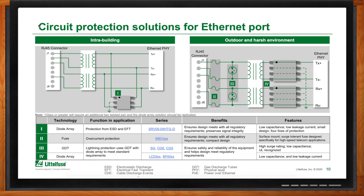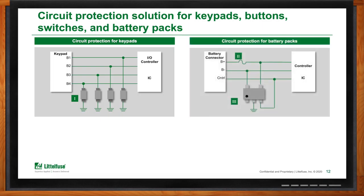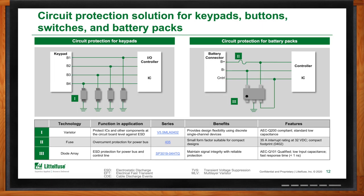Let's slow things down and talk about lower speed applications. Here we see an increased use of non-silicon devices. Silicon-based devices react faster, so for slower data speed ports and less sensitive ICs, non-silicon devices become attractive — like using a multi-layer varistor. The MLA series can provide a good ESD protection option because the speed is only as fast as you can type, like a keypad. For battery protection — an internal port — a small PPTC or fuse like the 435 provides overcurrent protection, while the SP3019 diode array provides ESD protection for the power lines and control lines in a single device.